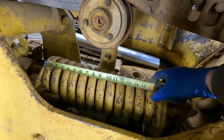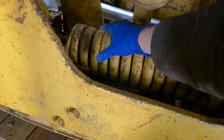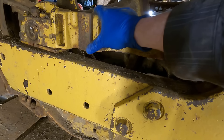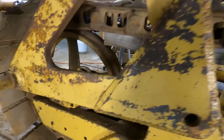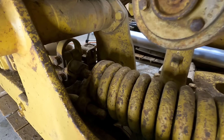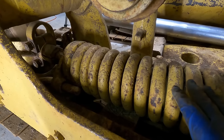On a good spring, the distance from spring bottom to spring bottom is supposed to be 18.25 to 18.5 inches. This one measures 17.5 inches, and you can see two coils touching — the spring is definitely bad, which is why I got another one. Up on the front idler there are blocks on either side, about an inch each, probably added to take up slack. The bushings in here are lifted, meaning the track was basically loose before I put that block in. The threaded rod in here is also tilted, so there may be more issues to find once I get it out.